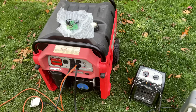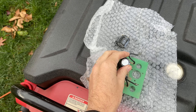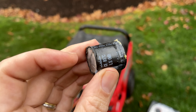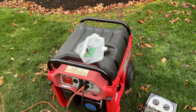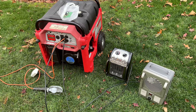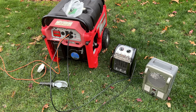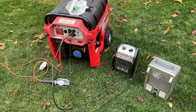It's been just over a week and Gary already sent the repaired board back. I'm not going to install it now — I'll put it on a shelf for a rainy day. He said the diodes were actually good; it was the capacitor that was shorted out and caused the unusual readings I was getting when testing that bridge rectifier earlier. Anyway, let's get this started — we'll let the engine warm up and put it under a 3,000 watt load and see how both the engine and the generator head perform.